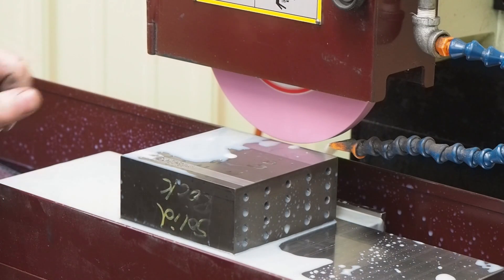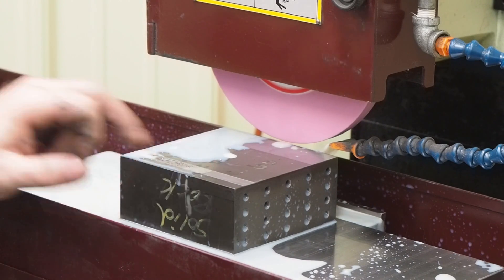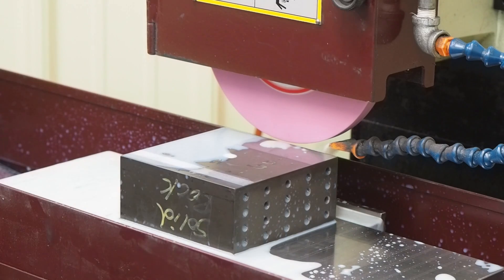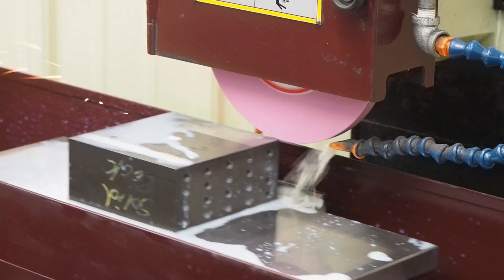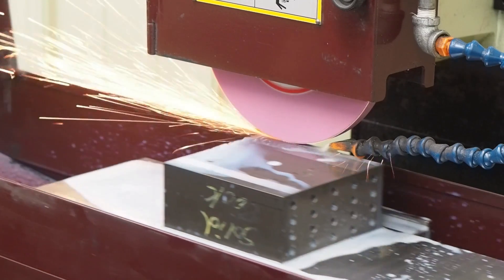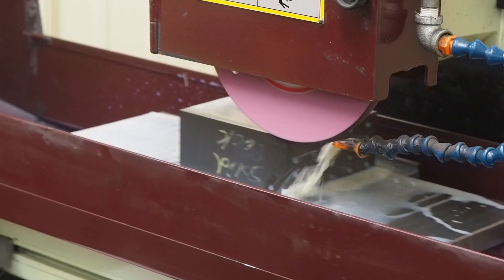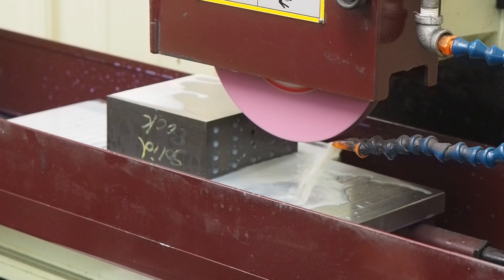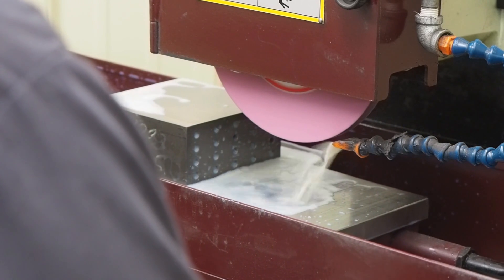Now this is that F hardness wheel. I just touched off my high spot, and when I put the guarding on I didn't realize that I wanted to nip another thousandth, so I got a strip down here that's about a thousandth deep. Our first cut we're just going to take a thousandth off and see what it looks like. It definitely sounds nice. For a thou cut the finish looks pretty good — I'm just going to go about five to six tenths.